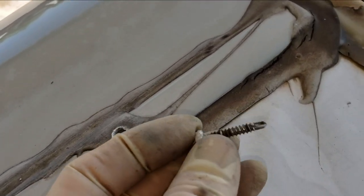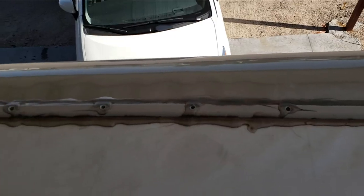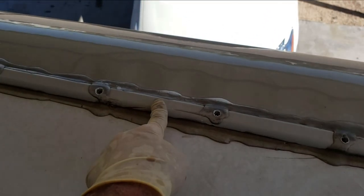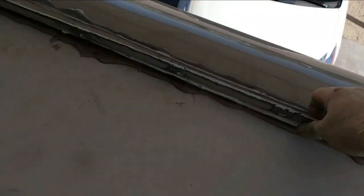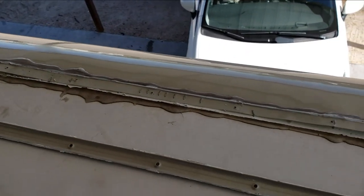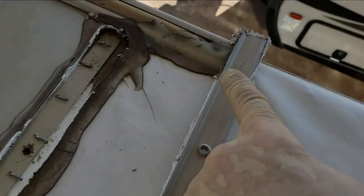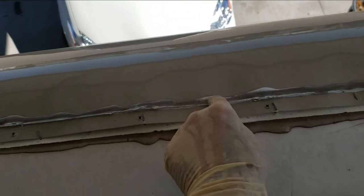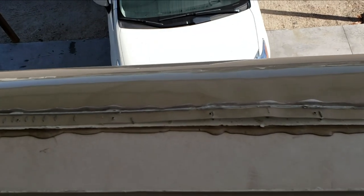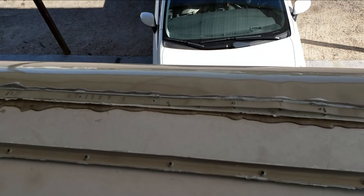I'm not saying I had a problem too, but this is the screw I took out of that side and it's all rusted. I don't think anybody did anything wrong other than build it wrong. Let's get this pulled up and take a look. I don't see any sealant here — I don't see any sealant on the bottom of the molding. They never sealed this thing. All they did was screw it down and seal over the top. That flashing on top is meant to redirect water — the sealant underneath is the actual primary seal. There's one of your problems.